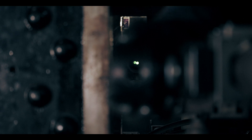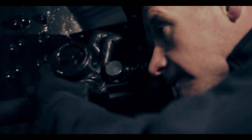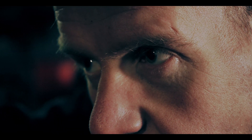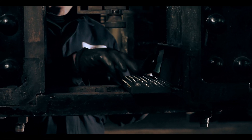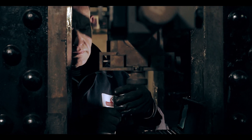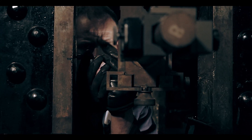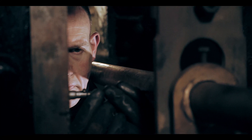That then means that we've got the bar, which is effectively a dummy axle, 90 degrees to the frame. So we know everything's in line and we can then measure to the leading and trailing wheels to get those on the right centers.